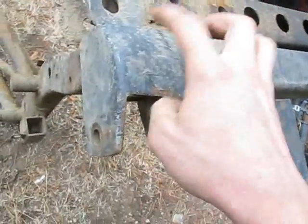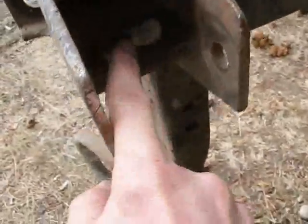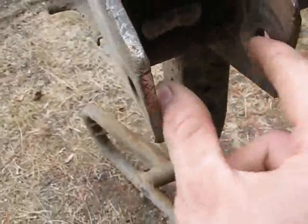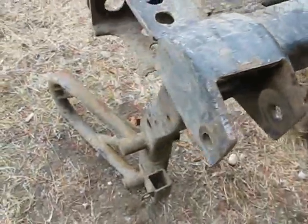And then I just bent a couple pieces of steel and welded them on for the front kind of bash guards or whatever. They protect the springs, but as you can see, I guess I didn't lift it. This hole wasn't dropped enough and the spring was rubbing on the frame, so, you get it.